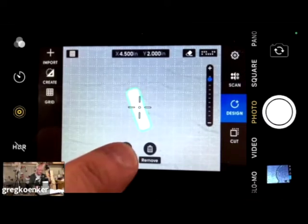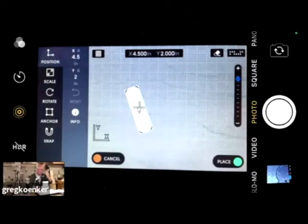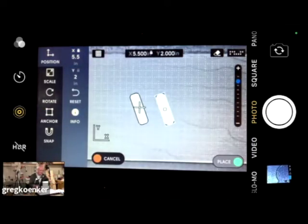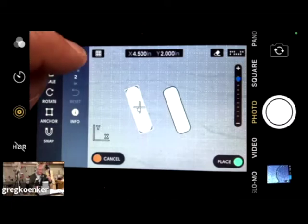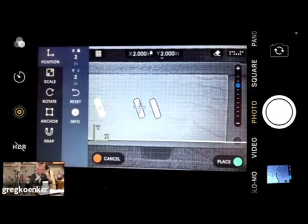So all I'm going to do now is say copy, and position that plus 1 inch, and click it to lock it down. Now I'm going to copy and position the X direction 2 inches. Whoops, and -2. You get the idea. Anyway, you can set up a series of those mortises for slats on a shutter or whatever. That sort of application you could do.